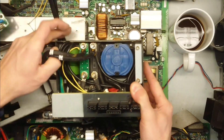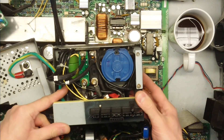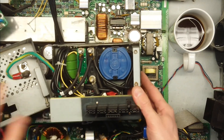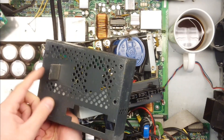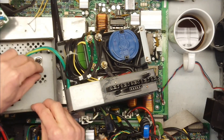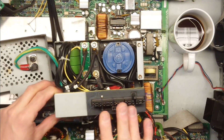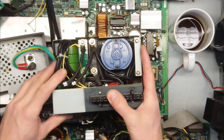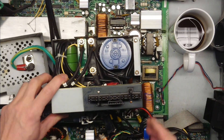If you look inside this connector box, it's quite packed with stuff. There are some ferrite cores for filtering. Underneath we have all the terminals — there is the bypass and normal switch, a three-throw, three-phase switch. Over here we can see the ground connections to the chassis go out to a large connector that inserts into the rack system this is mounted in. It's also extra protected against short circuits, with a lot of nice safety details. This whole box connects with terminals that just slide into the unit, so you can actually change the whole input box for another country's standard or customer preference — a nice modular design.